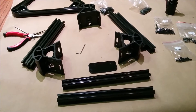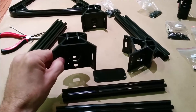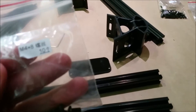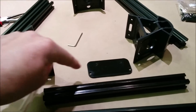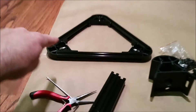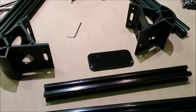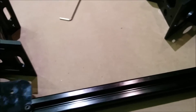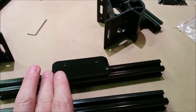Now I'm working on the bottom triangles. I have the vertex — you can see the circle on the bottom, that is the bottom. I have the short bars and this piece right here, which called for M4 by 8 screws. I've got two of them on the wider side and a little nut behind them, just like we did on the previous vertex. Then slide it in to this one. I'll resume here in a minute when I have those nuts in and can slide it on.